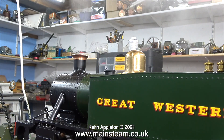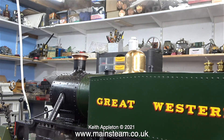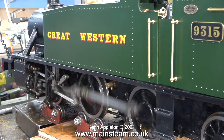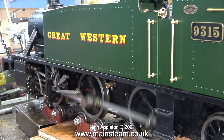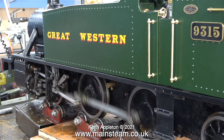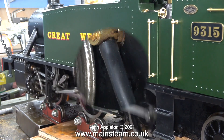Here's something worth mentioning. It doesn't really apply when you're running the locomotive on a track, because with this amount of steam pressure — which is very low — the engine wouldn't even run. But sat on a test bed you can run the engine at very low pressure, though it's not a good idea because quite a lot of very wet steam is rushing into the cylinders, and now everything in the vicinity of the engine is covered in a mixture of steam, oil, and water, which I need to clean off before I can use my workbench again.